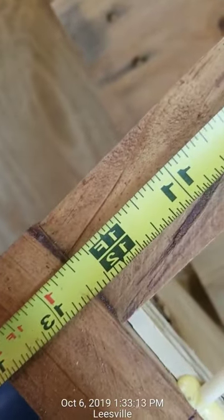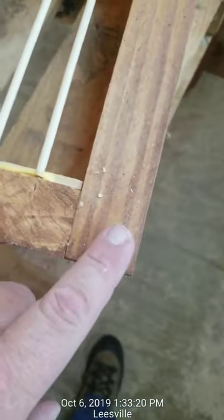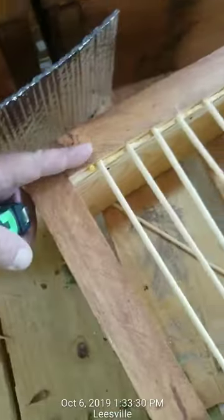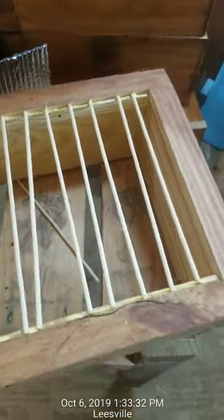What you want to do next is put them on the chop saw and cut them to twelve-and-a-half inches. Now you can see how I make my joints — it's kind of a weird thing, but I make all my boards twelve-and-a-half inches long. Screws go together here, goes down this way, screws that way, goes down this way, screws that way, and you make a little box.